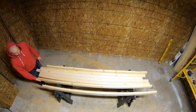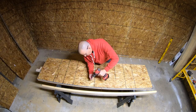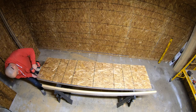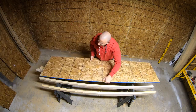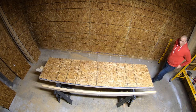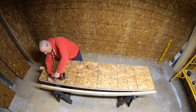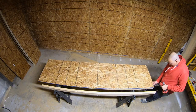When designing your shelves, you can choose larger lumber for heavier storage. I'm using 2x3x8 feet long and 3/8 plywood or OSB. Next step up would be 2x4 8 feet long and 1/2 inch plywood. For warehouse or paper storage, I have built with 2x6 8 feet long and 3/4 inch plywood.